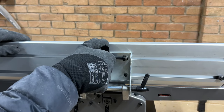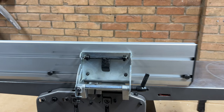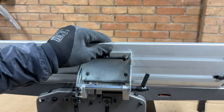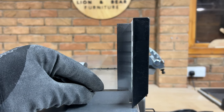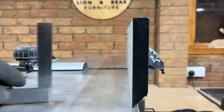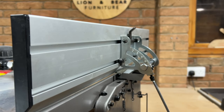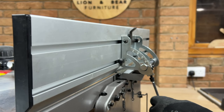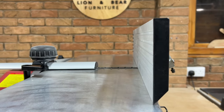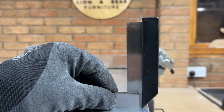The fence has this little flappy thing that opens and locks off the horizontal adjustment. It's a little stiff but it's not too bad. You'll need to use this when converting from planer to thicknesser and you'll keep it locked when it's in planer mode. Once you've got your fence attached you'll need to check and adjust it to make it square to the bed using a reliable square like an engineering or machinist square. On mine the fence was slightly out — you could see light behind the top edge, meaning the top needed to pull inward. You can fix this by loosening the nut and adjusting the little screw on the fence adjuster, then lock it in place by tightening the nut back up.